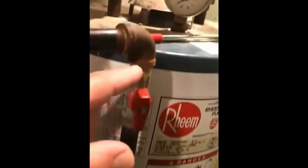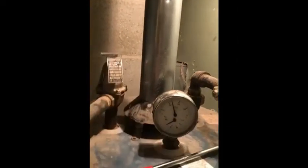The deal with this natural draft water heater is that combustion byproducts and hot gases rely on the natural buoyancy of those gases to rise up through the vent connector and through the vertical chimney. So it relies on natural draft — just the buoyancy of those combustion byproducts.